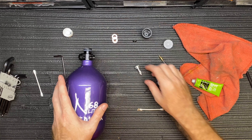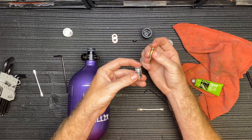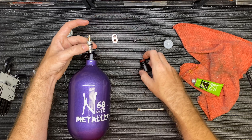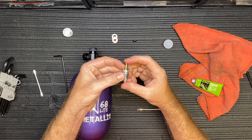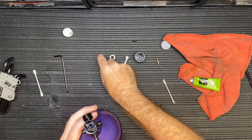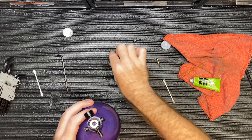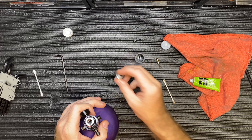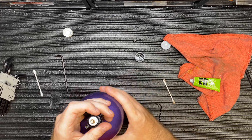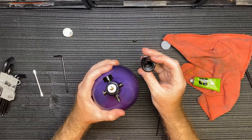Just to show you how everything goes back together: you have your piston spring, your piston, your pin spring, and your pin, then your bonnet. The piston and spring sit inside the regulator, and when you air it up this piece has pressure against it — pressing down that pin allows air to come out. Now put the regulator shims back in first; order doesn't matter, just drop them in. Then drop in the regulator piston spring, then the regulator piston. Take your pin and pin spring and set it in place.